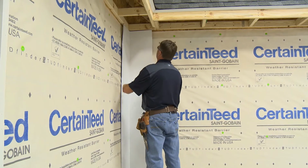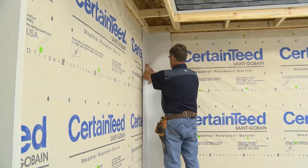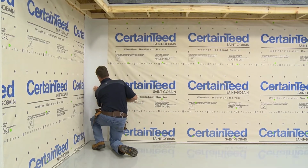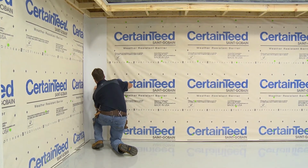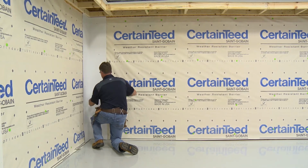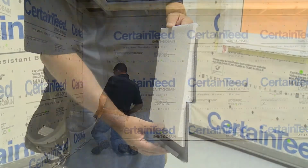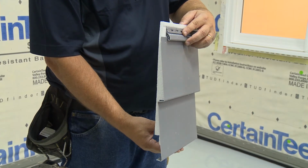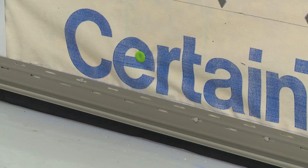As with all other sidings, be sure the substrate is smooth, flat, and weathertight before installing CedarBoards siding. If the surface is significantly uneven, apply a 1/4 inch foam sheeting before installation. Insulated siding is thicker than hollow vinyl siding. To accommodate the 1 1/4 inch thickness, we suggest using the CedarBoards starter strip.